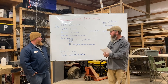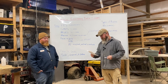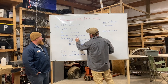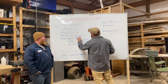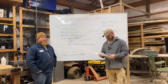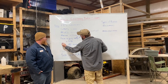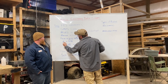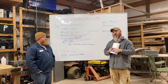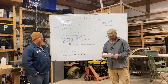One key difference between UHF and VHF: UHF is better for indoors — it'll penetrate structures better and it's better for urban areas. VHF is better for outdoor use; it doesn't go through structures very well at all. It all has to do with the wavelength.